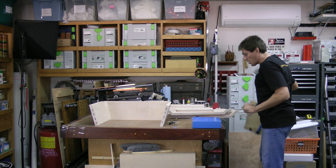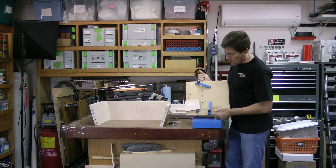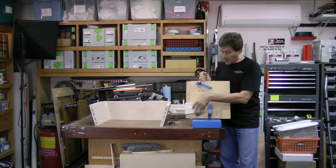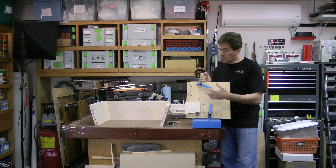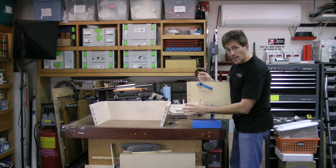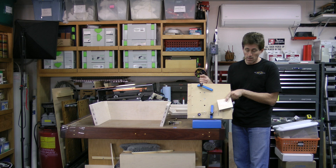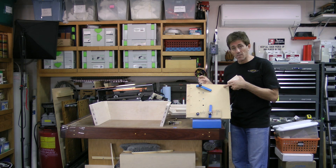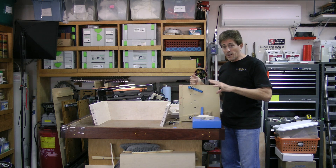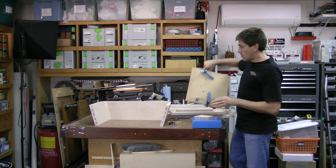For the smaller pieces, we're going back to the sled. With the sled, when I put the piece on it — square to the edge — that's actually how I cut the bevel on the outside edge. We're going to run the dado stack cutting the rabbet into the edge. The left-tilt catch means I'll have to cut the other side by moving the piece to the other side here, shifting it to the other miter slot. This turns something that would be really awkward into something pretty easy.